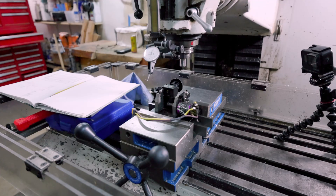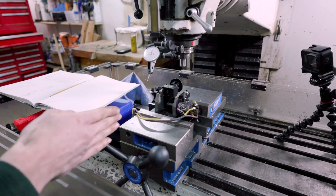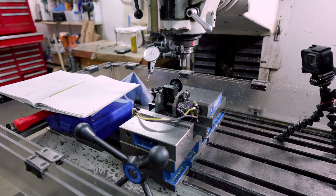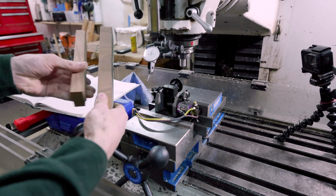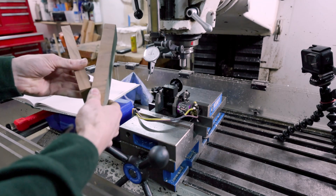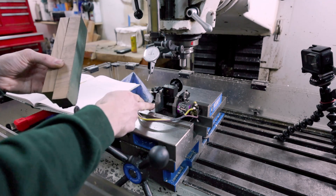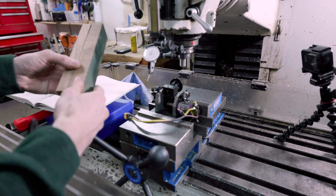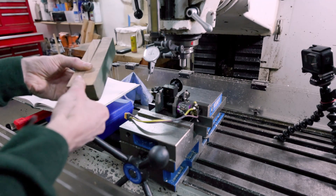Oh man guys, this is not good — I mean it's great, but it's not good for me. This carbide block is absolutely dead perfectly square with the table, which is fantastic, but that is a super high bar for me to meet. Now this one is five thousandths out of square. And then for the front face — for how in line they are with each other — they are perfectly aligned, plus or minus half a thousandth.